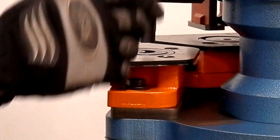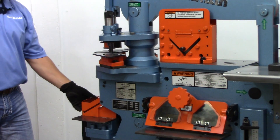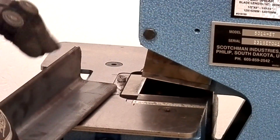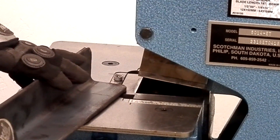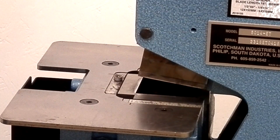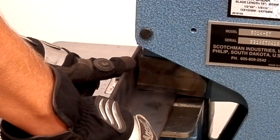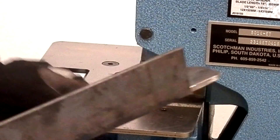Now we put the punch station back in the center position and go down to our rectangular notcher, which has a 3/8-inch capacity on a 50 ton machine. This is very handy. I'm going to make a butt joint right now for an angle shear frame — but literally however you stick your material in there, this is going to nibble it off for you. Our notcher is guided on each side with wear plates; it does not allow the beam to flex at all, so you can do jobs like this without any worry about side loading your tool.